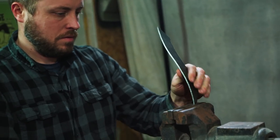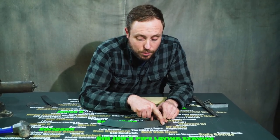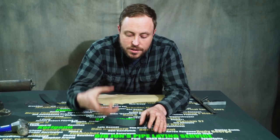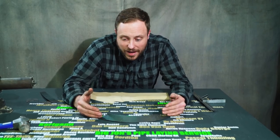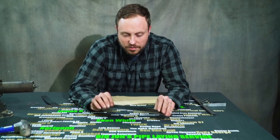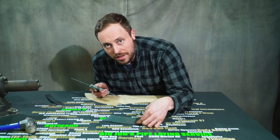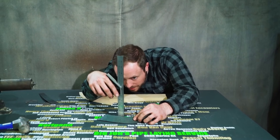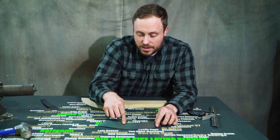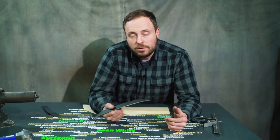It's easier to unbend it than to bend it. So if I do this the whole way down the blade and then straighten it back out to the correct level by smacking it on the little anvil section, it should work out. The front edge is the edge of the blade and the blade has to be just over an inch thick, so each side has to be half an inch tall. As I'm bending, I can lay it down on the table and see if that front edge lays flat — if it does, it's curved evenly. I can also check if I've reached the right height accounting for the thickness of the metal.